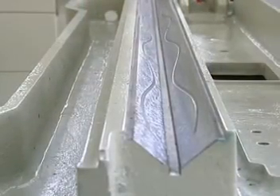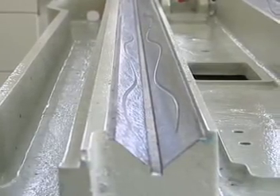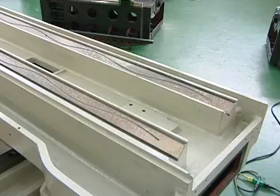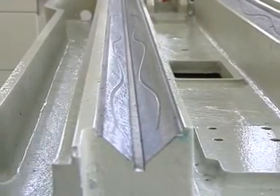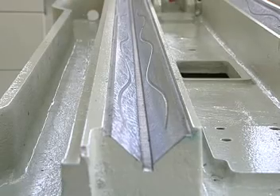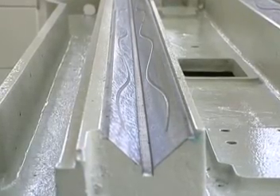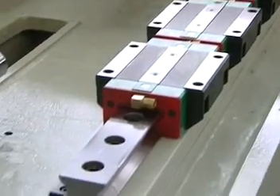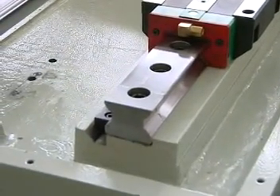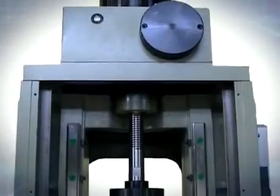The longitudinal X-axis table travels on double V guideways. The hand-scraped and precision-fitted table provides the following features: the four sliding surfaces of the double V ways provide a high contact rate, giving more constraint and higher guiding precision. They may automatically fill up the gap when worn out to maintain working accuracy. The slideways for back-forth and up-down movement along the Y and Z axes use high-precision linear guideways.